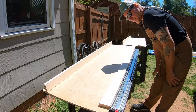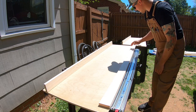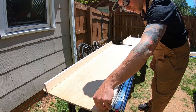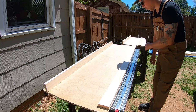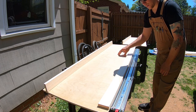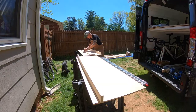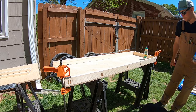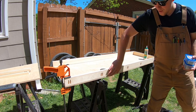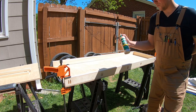Good morning guys. One of the first things I wanted to make sure to do is find out where the holes are going to be drilled into the side of the side rail. I didn't want the pocket holes to be in that, so I just lined up where I think the drawer will be and tried to go through the bare metal spots where there are no holes. I'm going to have five pocket holes on each rail, and that'll hopefully with wood glue have a solid connection point. I'm going to clamp all four corners so everything lines up with the edges of the wood. Before clamping it down and screwing them in, I'm going to use Titebond 3 Ultimate Wood Glue — I've used it in past videos.